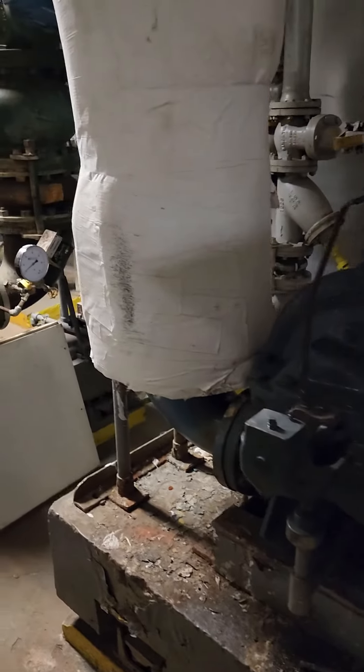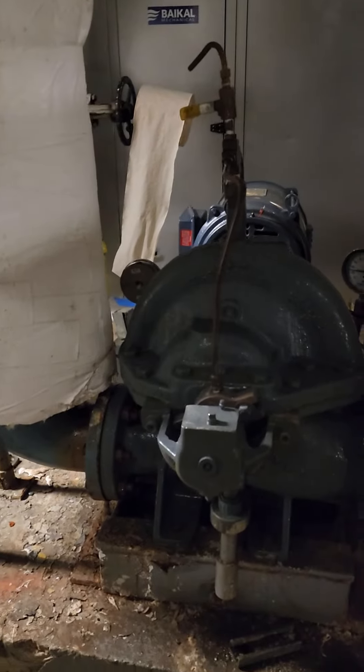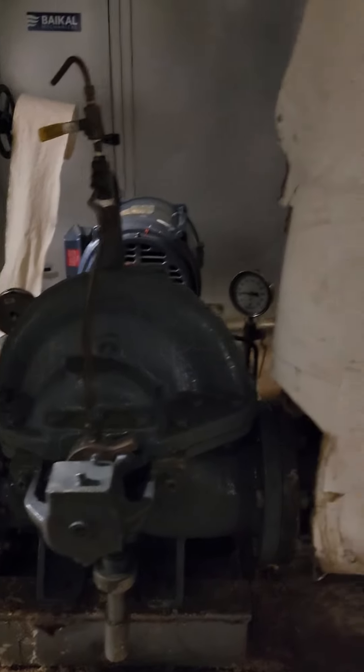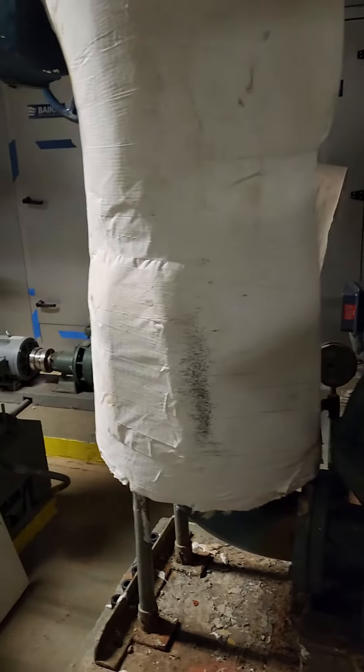That's the reason — if our lines were not insulated, the entire line would be sweating. And the thing with sweating is that's heat transfer. So if you had 40 degree water going out and your entire line was not insulated, by the time it gets to the unit, you would have lost so much of the cooling.